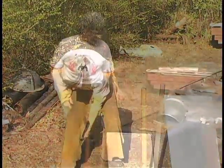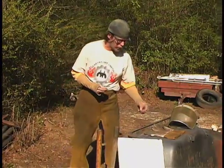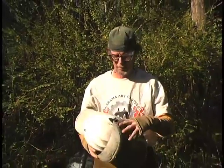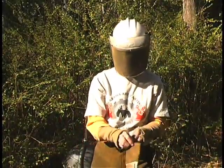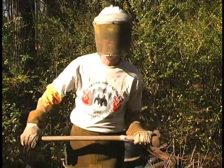so you can overdress. One of the overlooked parts of breaking iron is that a hammer on cast iron makes a very sharp, very high decibel, very quick report. And that's overlooked a lot. So finally, to be fully dressed out: boots, chaps, spats, low end protection, but most important of all is eye and ear protection. Good safety glasses, earplugs or hearing protection of your choice, and absolutely a hard hat with face shield protection of your choice. Gloves, hammer, a good attitude, and you're ready to break iron.